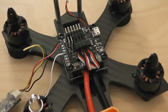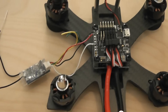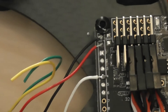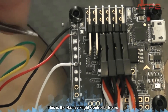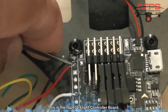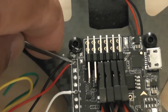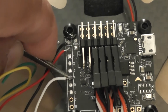If you want to go with an S.Bus setup, it's going to be very simple — just like that. Get your S.Bus receiver and it's right here. All you need to do is remember: pin one is the ground pin, pin two is five volts. So black goes to ground, red goes to five volt.